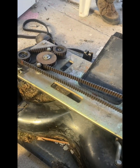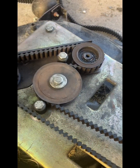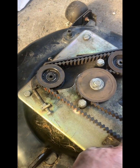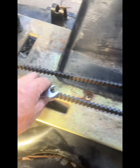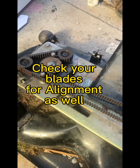All right, now make sure you lock the bottom of the nut under there. Do the same, lock it all off. Tighten these up. So after you nip all your bolts up, sometimes when you tighten everything up, it can tighten your belt back up on something. So just double check your tension, make sure it's okay. So we're right there. So top back on, back in the mower. So all done.